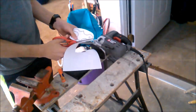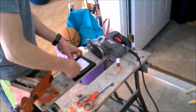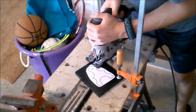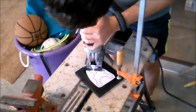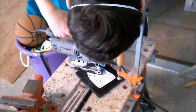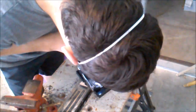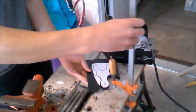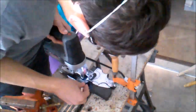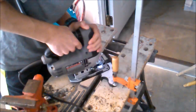The first step is obviously you're going to cut out your template and glue it to the stock material. Make sure to get all the edges, because if one of the paper edges comes off while you're sawing, you could have a really bad cut because it's showing the wrong angle. So make sure to glue it on nice and tight, and cut it out with the jigsaw. I'm just using a thin scrolling wood blade for tight corners — works really good.